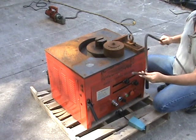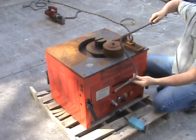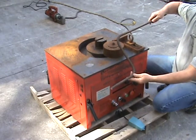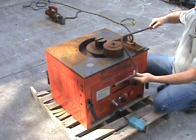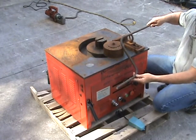Even if you wanted to bend a hoop, you could do that if you're creative. This is a good demonstration of an inch-and-a-quarter bender bending grade 60 5/8 bar. You see how quickly it did it — it can do a bend in 4 seconds when it comes to inch-and-a-quarter bar grade 60.